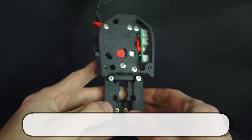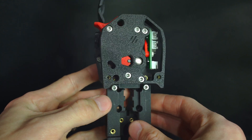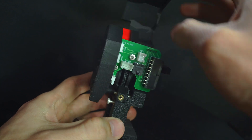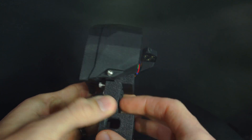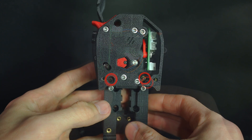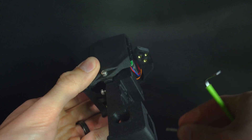The version I received is a pre-production unit, which uses the Clockwork 1 carriage as opposed to the Clockwork 2 carriage. This has caused a bit of confusion, because Clockwork 1 and 2 are the extruder designations, but there are also two versions of the X carriage that use the same naming convention. The Clockwork 1 carriage has the extruder mounting screws enter from the rear, while the Clockwork 2 carriage has the screws enter from the front. Based on feedback from beta testers, all retail units will ship with the newer carriage design.